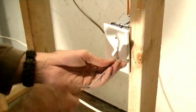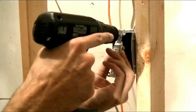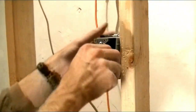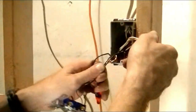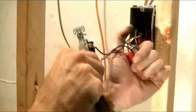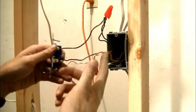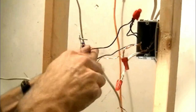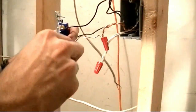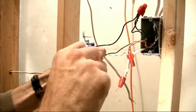Save these screws for your faceplate. Pull out while you're doing it — it pulls straight out. Everything comes out winding. Then your white, since your white was always tied in, it'll be off to its side. So we know this is your power leg and this is the switch leg. So we know we have to take off both of these switch legs because they both go up top. The only one that we're going to save is that bottom wire, that 14-2 going to that GFCI.